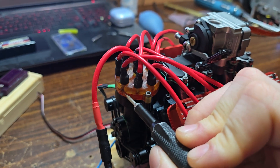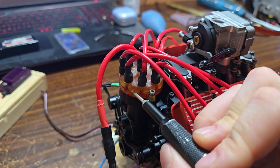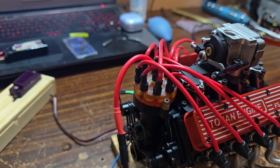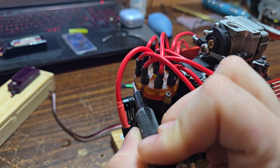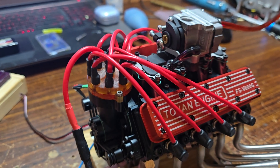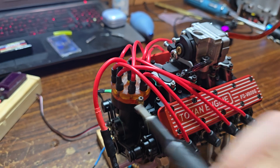That tiny little groove that goes all the way around can now travel in between the posts. So when one cylinder is supposed to fire, sometimes it hits the right one, but most of the time it skips one and jumps right to cylinder five — which is not even ready to fire yet. It should not be sparking in the middle; it should be sparking on the money.